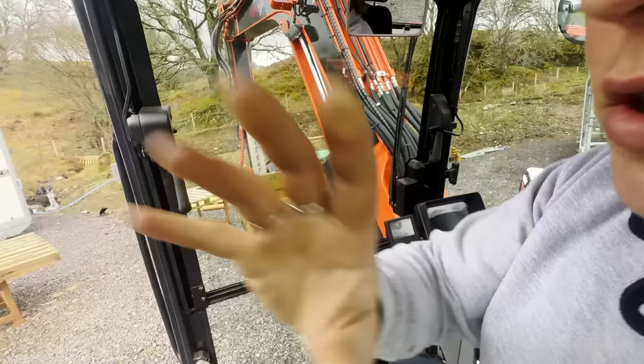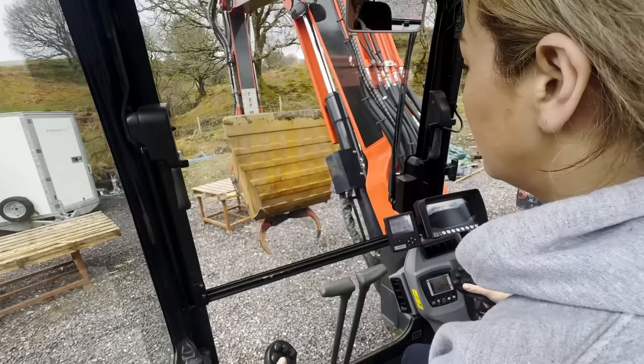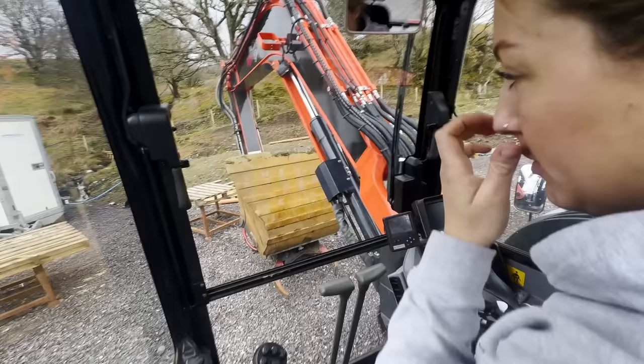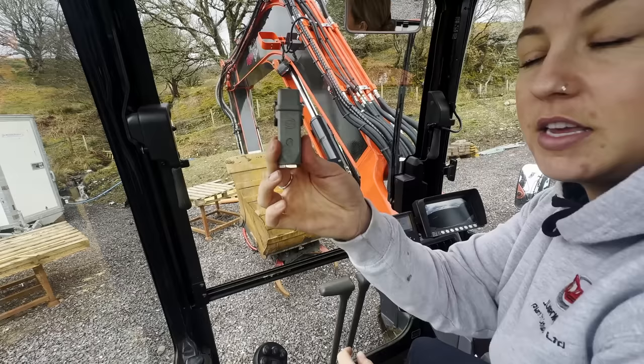It's Tuesday morning. I'm back in my own machine. First thing I'm going to do is take off my rototilt because I'm digging trenches today. I'm not quite sure of the layout yet - I need to get the map out - but I know it's 60 metres long, supposed to be a metre deep and a metre wide. I'm going to take the rototilt off anyway because it's going to be a lot of digging. Don't really need it on for this. So let's get this off. First step when taking the rototilt off is to shut that door, then open the claw out at the back. Curl it right round to get ready to release the pressure on the hoses, then turn the machine off.